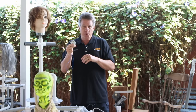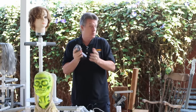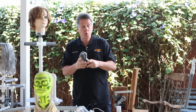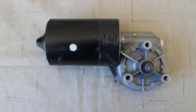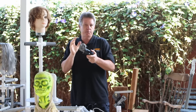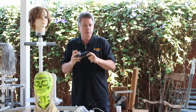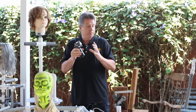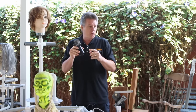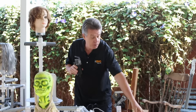Reindeer motors are available from Kindy's for about $12 and are really handy. You can also get the motor that's actually inside those off the web in a variety of different RPMs — you're restricted to whatever it comes with if you order the completed kit, but buying them separately gives you more options. Reindeer motors don't have a whole lot of torque — about the same as a vent motor — so they're primarily used for lightweight props.